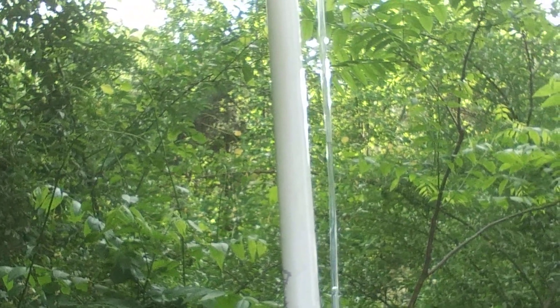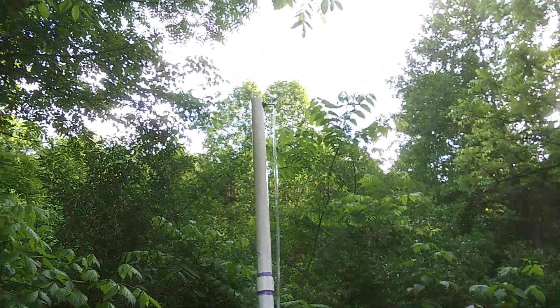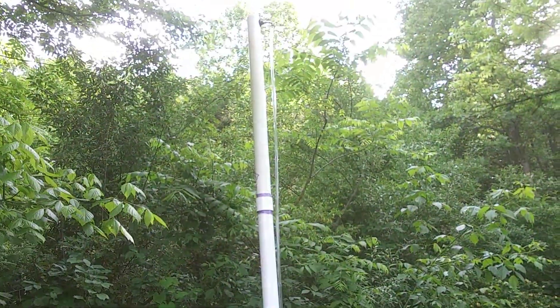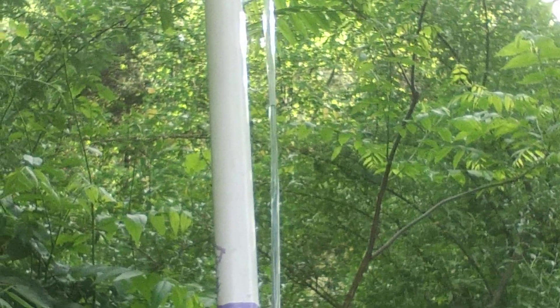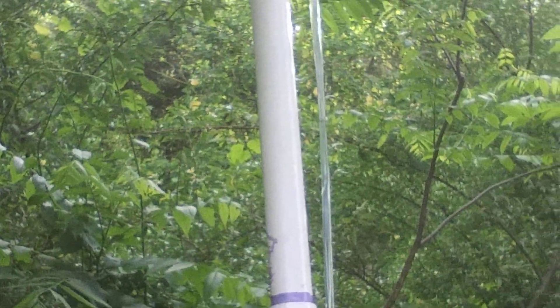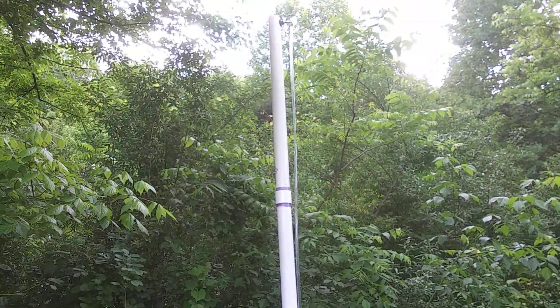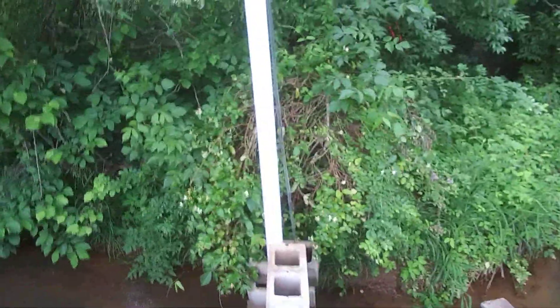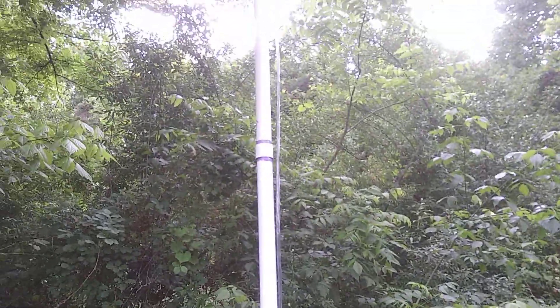You can see that air bubble coming up and the water pulsing right there. I like that it's staying that high — that means I did a good job getting the air out. If the whole standpipe is 15 feet tall, I'd say I'm at about 12 feet of water level right now. That way I know my water level is exactly right there in the standpipe. It's good for diagnosing things. I post videos to hopefully help somebody figure out what they want to do and how to do it — hopefully that helps somebody out.